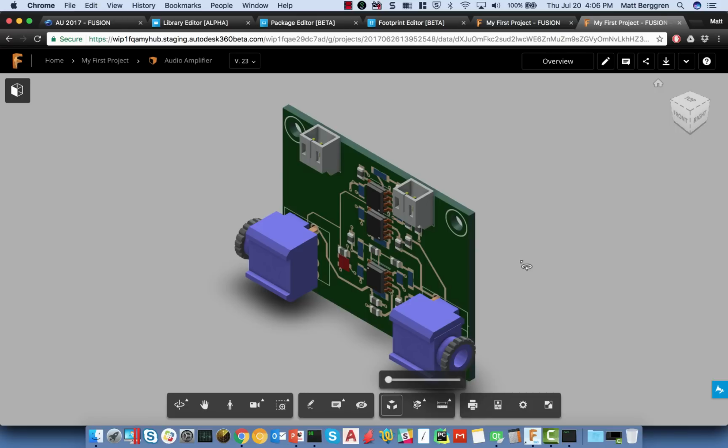Remember, before I said that we didn't want to build something which was purely file-centric. We wanted something which was data-centric. This is a representation of what we call the Fusion PCB. The Fusion PCB includes things like board shape, component positions, holes, slots, that sort of thing. But it also includes reference to the individual components, both their mechanical and electrical equivalents. And all of that is stored and then versioned automatically. So as you link data from Fusion into EAGLE and EAGLE into Fusion, you'll be creating versions each time that you do the push-pull process.